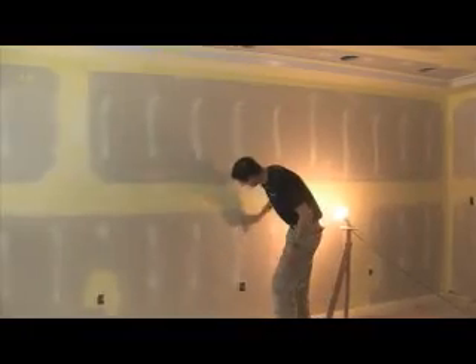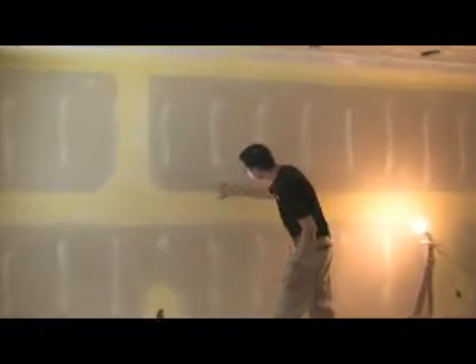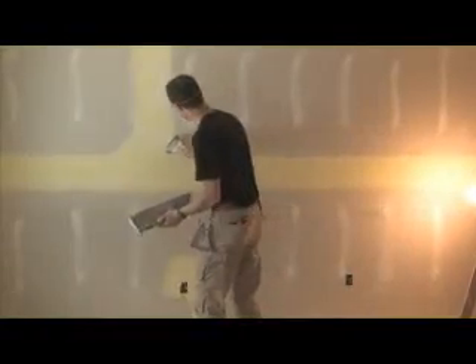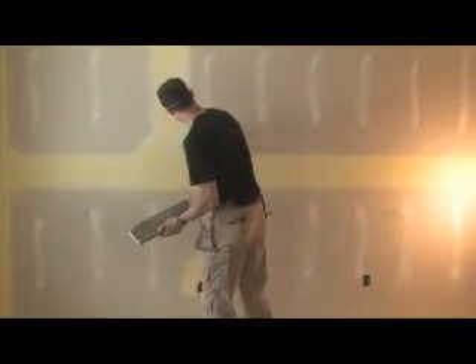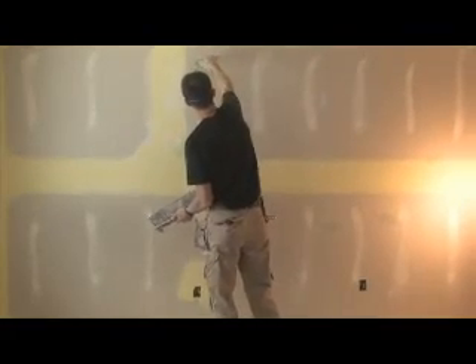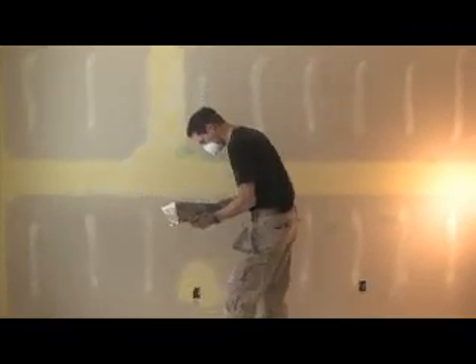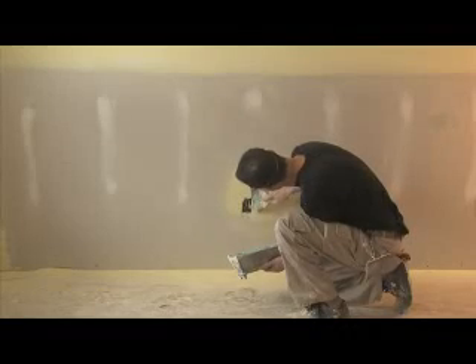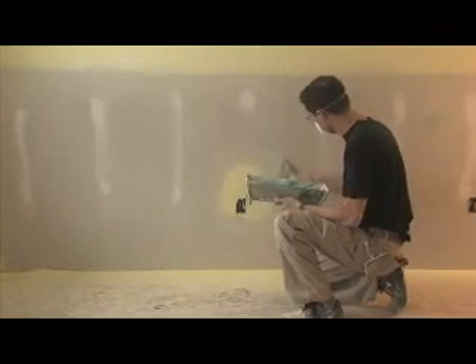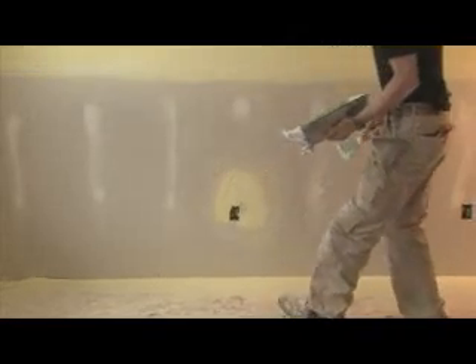As you do your final sanding, a bright light helps highlight any blemishes. Those blemishes that can't be sanded out are touched up with joint compound. Using Never Miss helps highlight any touch-ups. Later, when the final walkthrough before priming is done, there is no need to drag along a light to help highlight the spots that need to be sanded. The extreme visibility ensures that you never miss what you have touched up.